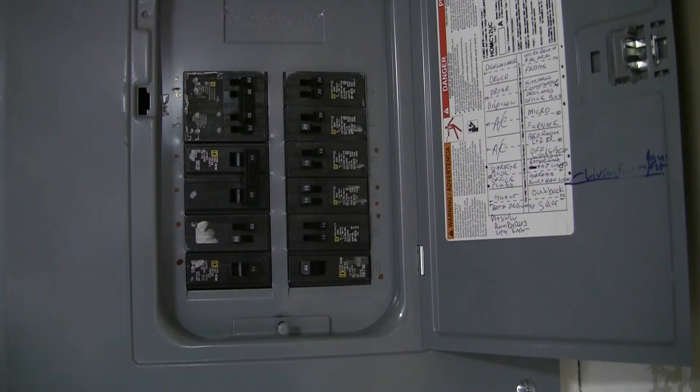They go from 26.4 down to 25.2 overnight as it gets colder. I told him about that — 25.2 is a fully charged battery bank with pretty much no load on it. There's about a 0.03 amp draw overnight from the inverter running. He said that's nothing, that's normal with the cold. He asked the temperature — I said about 65 degrees — he said normal, you're just losing a little capacity. He asked what kind of box it's in, I said metal. He said metal radiates cold, that's cooling them down, and recommended a wooden insulated box.